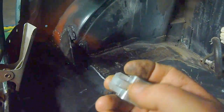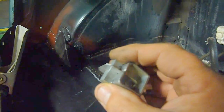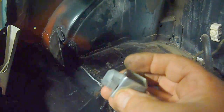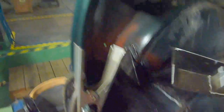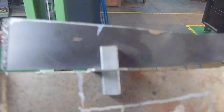These are really good, because if you need to do a butt weld — where you're welding two pieces of metal in line with each other — the standoff in the center is the perfect gap for MIG welding. And this is what it would look like if you imagine these were two pieces. So that's the kind of gap that it gives you. These two pieces are just off-cuts, so it wouldn't be perfectly straight, but that's the kind of gap that it gives you.